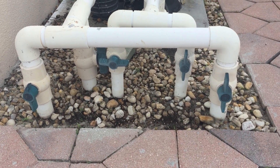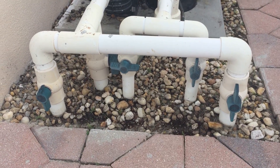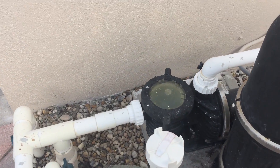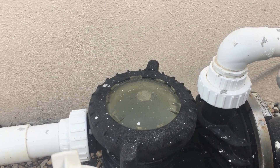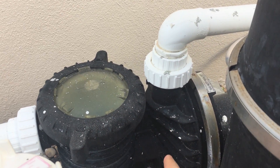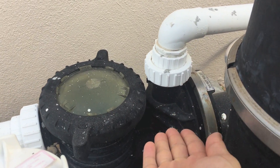This particular pool has two main drains — main drain one, main drain two — and then also the skimmer line. So for those three, the water is sucked through those three pipes into the main adjoining pipe and it goes into the side of the pump. All the debris that is in the main drain or makes it past the skimmer basket gets deposited here in the pump basket. And then from there on the return line, it is pushed — so before we had the water being sucked through here, now we have it being pushed.